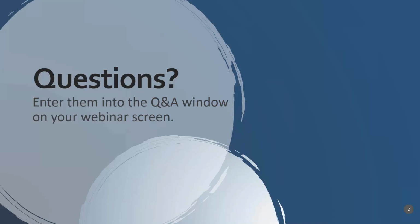Right. So there's the manual way of doing it, which you just described too, but also I believe it could be set up as a utility op. Absolutely. Is that correct? Yep. Yeah, you can build it in and say how much of advance is. So to answer the question, it's not done as a macro. It's done within GibbsCAM, defined by the user.